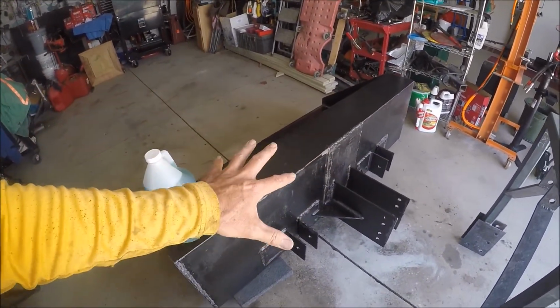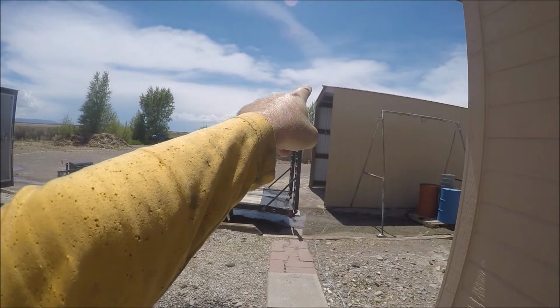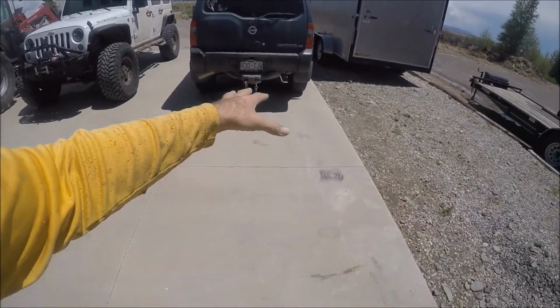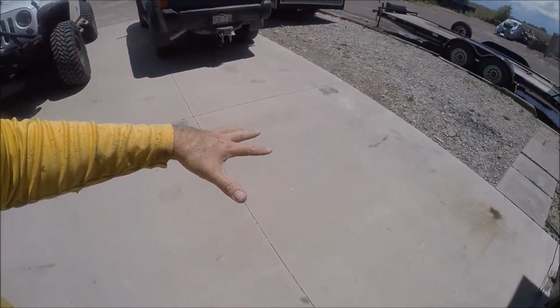and the paint sticks to it. It acts like primer, and it's just fantastic. Perfect example is this tractor barn, the steel frame. It was bare steel. It was I-beam steel that sat out here in the driveway in the rain and everything. It was all surface rusted, not terribly, but if you watch those videos, it did have some surface rust on it. Sprayed the phosphoric acid on, neutralizes the rust.